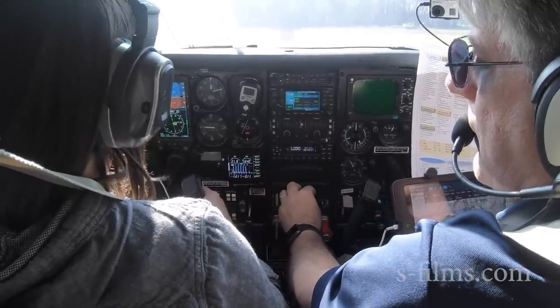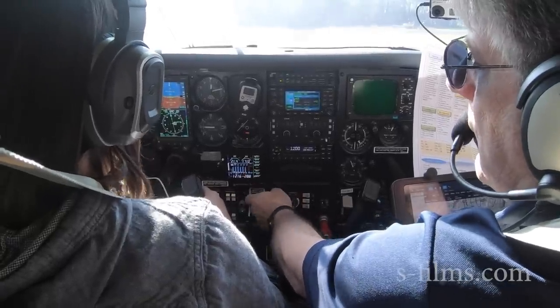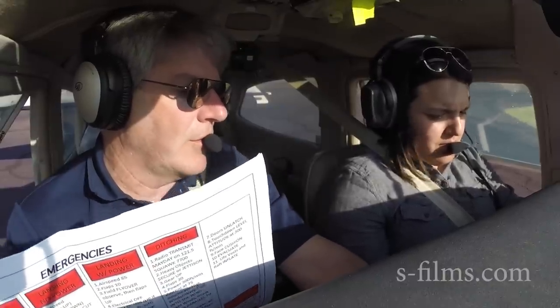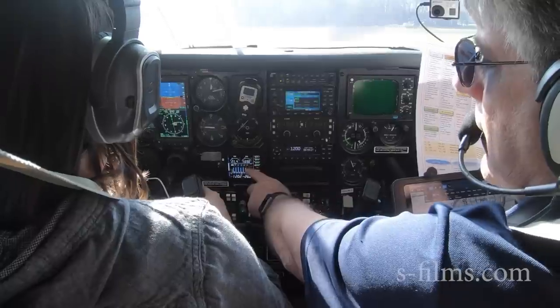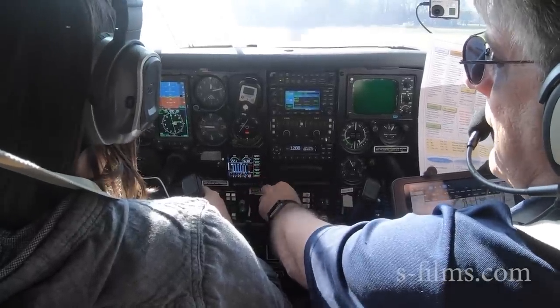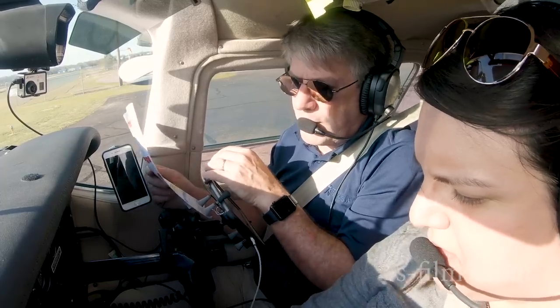Go back to both, let it get back, and then do one click left. We're checking the other mag, and we'll talk about what that means too. Is it back? I don't think you clicked it. Did you go to one? Because it's still at 1700. Yeah, I'm back in both. Oh, go to left. Go to what? Okay, there we go. 70 drop, back to normal. Both? Okay. Both. Okay, now do a prop. One pull on the prop.